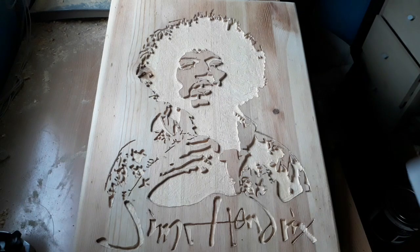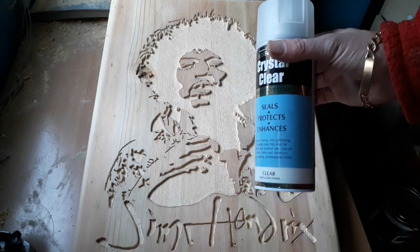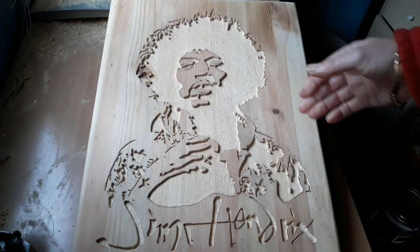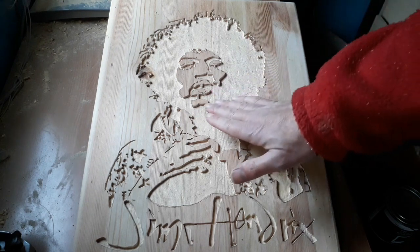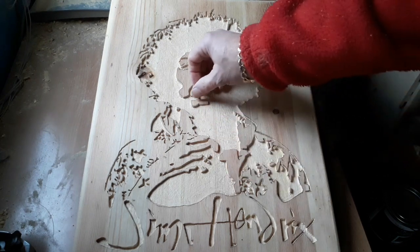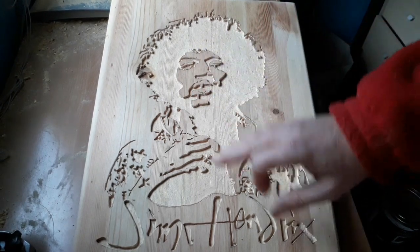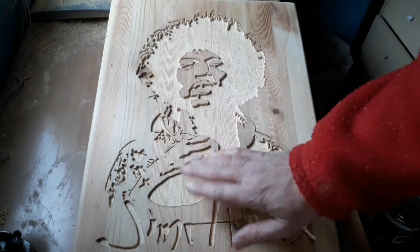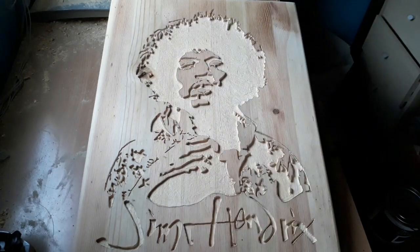Before we apply the paint, I'd like to apply some sealant first. I'm just going to spray that over and let it dry. Hopefully it will seal the ends of the wood fibres to stop the black paint from bleeding into them and making the edge less crisp than you'd like. You're always going to get some bleed, and some woods you can get away without using it at all, but this one's just a little bit powdery for me so I'm going to spray this first — simple job.